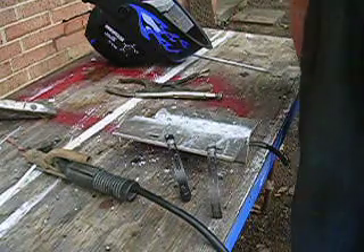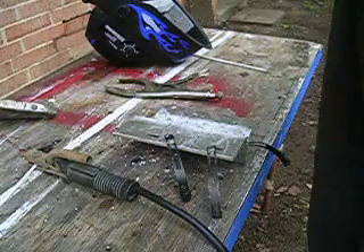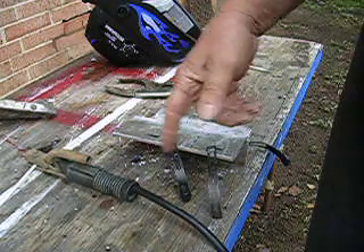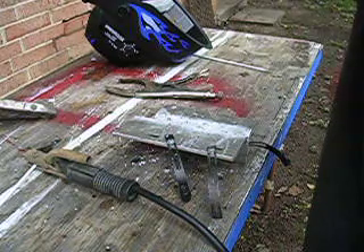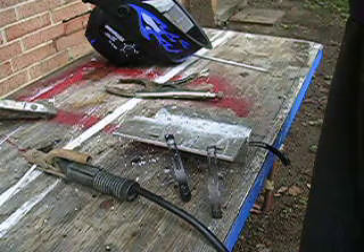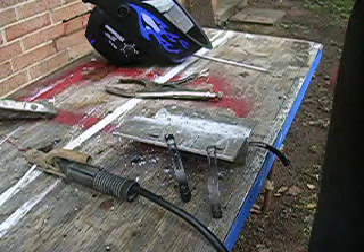I'm not a good welder. But that rod right there is used in a DC welder. It's plugged in the electricity. And just a rugged old stinger to put it in. And you do have to have your aluminum cleaned. You've got to grind down to bare metal. I'm just showing you that the rod works.